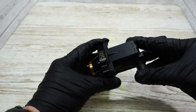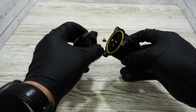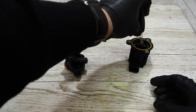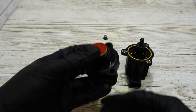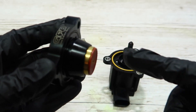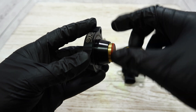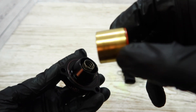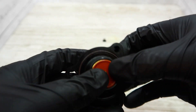So here we have it - the diverter valve. As you might see, when I took it off the car I lost the spring briefly. So if you are taking it off the car, try and take it off as one full piece and don't let these two parts separate. You've got the original diverter valve here, this is the solenoid from the original one - I had the Version D. You've got the spring that sits inside it, then a small piston that sits on top, and then this is the main housing that you get from GFB. This is the piston that everyone talks about not moving freely, but as you can see here it seems to be still sitting in the housing nicely - it's not wiggling from side to side, it's a nice tight fit, but it's just loose enough that it still moves back and forth freely. And from what I'm seeing here, it's really still moving well and showing no signs of sticking or failing.